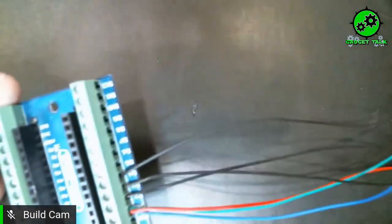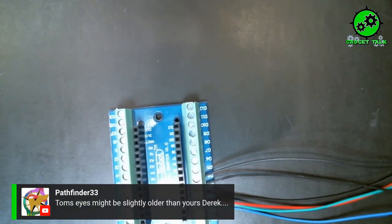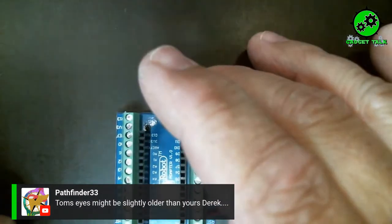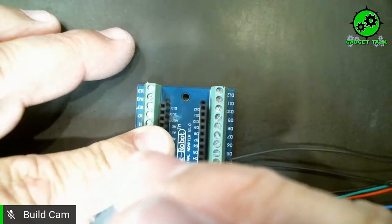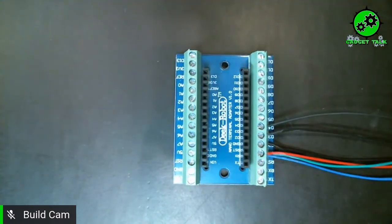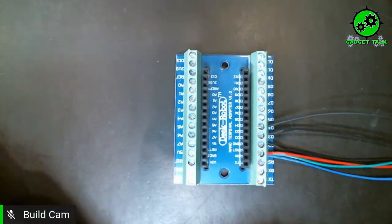This is how simple this is — we have our LEDs already connected to the board. Next we're going to go ahead and loosen up our ground and our VIN, which is our power in, in your ground terminal blocks. We're going to go ahead and hook up the battery holder. This time black is the ground — yes, that's correct. Just those silly LEDs with the reversed wiring.